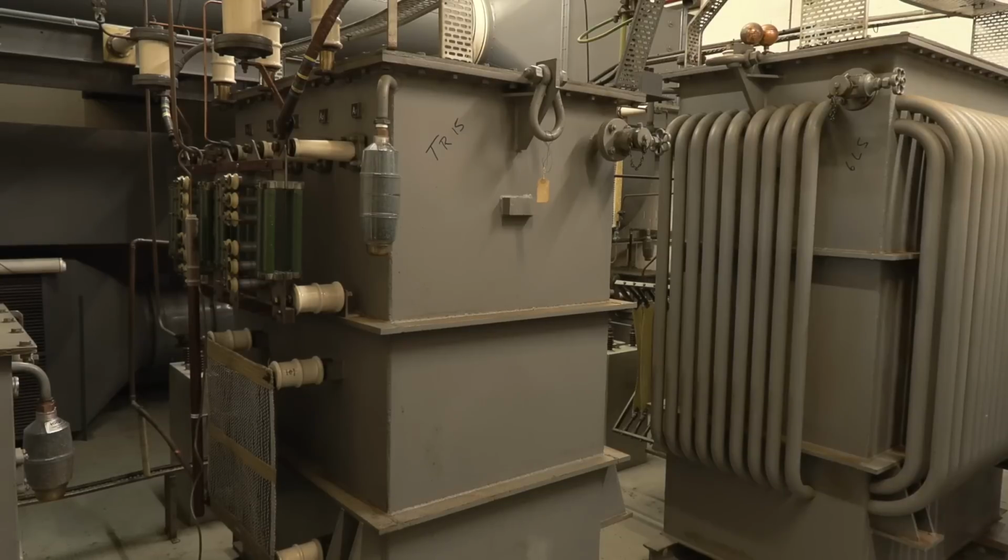One of the reasons that SSB took over at the beginning of the 60s was because it made your radios a lot smaller. Why? Because you don't need the modulation transformer. You do all your modulating at low level. We mentioned that those old AM transmitters are called boat anchors for a reason, because they always contain a big modulation transformer. Well, let me tell you, you've not seen a big modulation transformer until you've seen that.